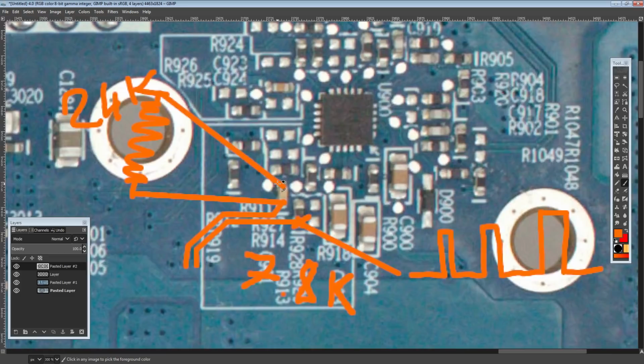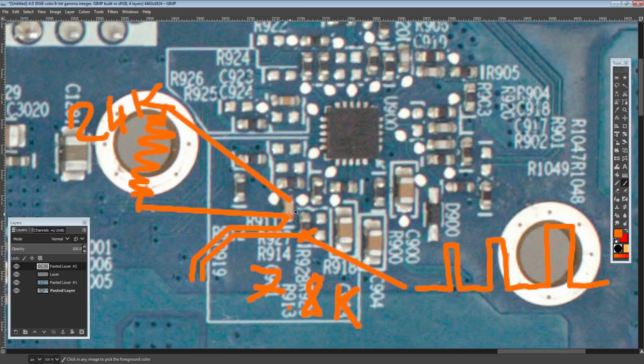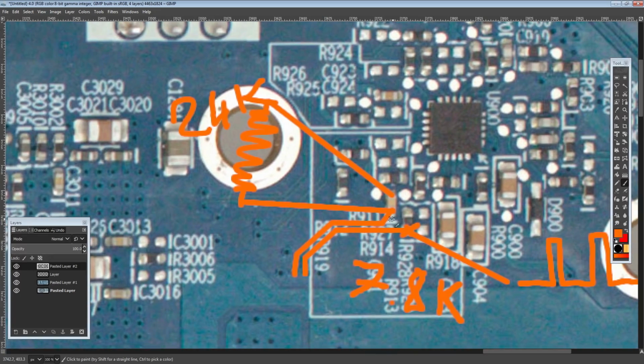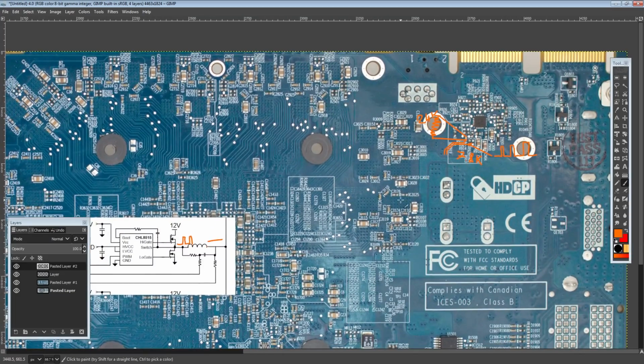Because this capacitor is tiny, and unfortunately for me, if you short across there, you're going to have a really bad day because this is actually hooked up like that. So trying to solder a big through-hole resistor onto that, no, I'm not going to be screwing with that. That's a pain. Way too difficult to do. So instead, I grabbed one of the dead GPUs I have and found a 24 kilo ohm resistor on it, and I was like, well, that's probably small enough, and smacked that on there, fired up the card, it runs, finishes GT2, card is repaired, really, really sketchily.